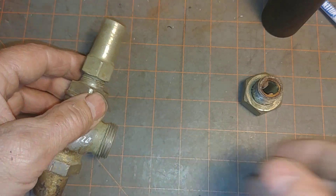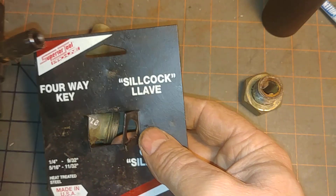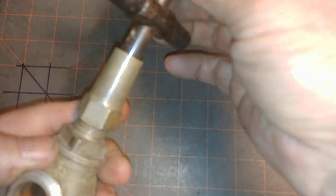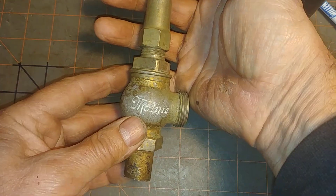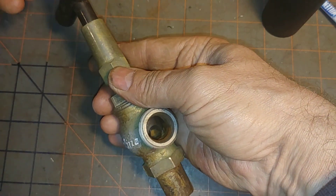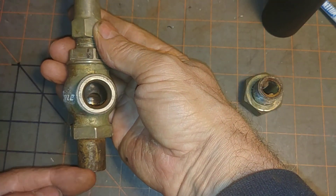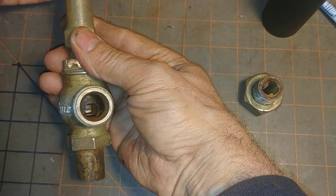They just had a shut-off valve. Fortunately, you can get a four-way key silcock valve, and one of the sizes just happens to fit. You would turn this down, turning the keyway, and you can see it shutting. And that would isolate it from any steam coming back in, so you could service the radiator at your leisure without waiting for the coal to burn down.